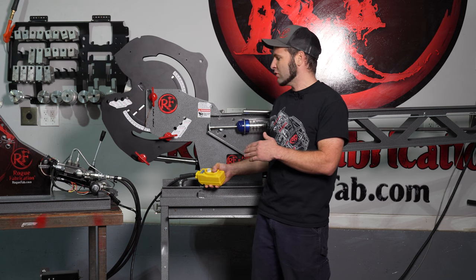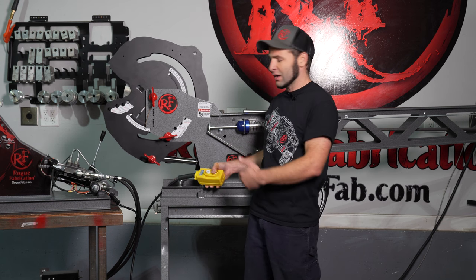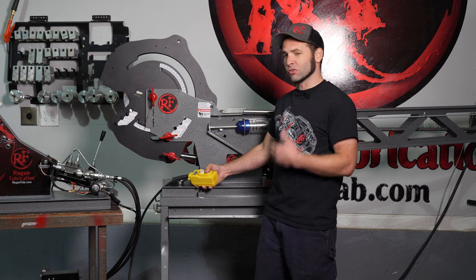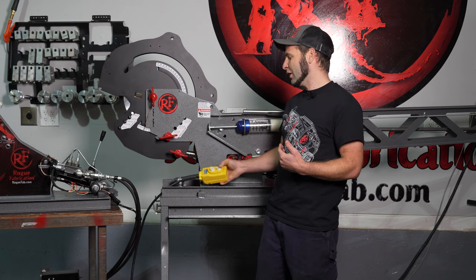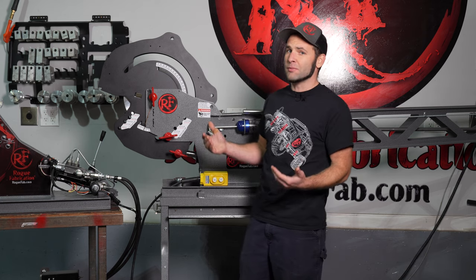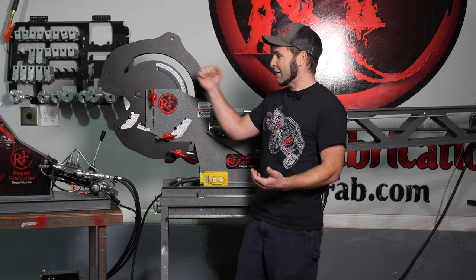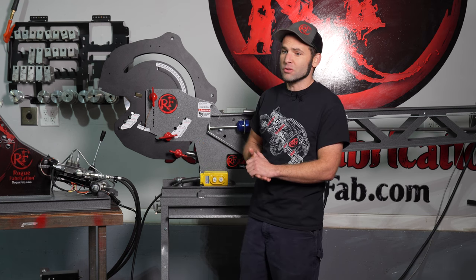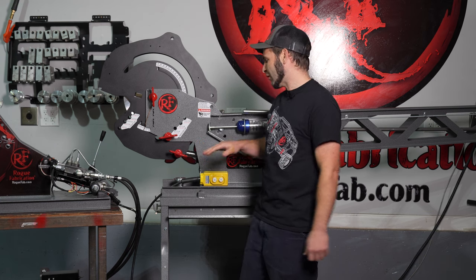It's kind of hard to see on this unit, but the return area has the rod subtracted from it, so all of our hydraulics are powered out and in, and they're going to be faster on the way back, which is great. Sometimes you actually want your tubing bender to have power going backwards rather than springs — it can help you get tube out of the machine if it gets stuck, and some other uncommon but very useful situations. So that's the one and a half.